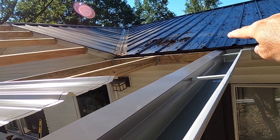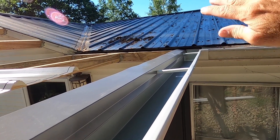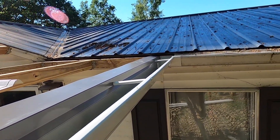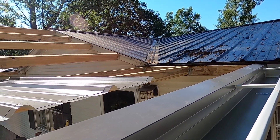Under the old roof I'm going to add a short section of roof for flashing, so that the old roof comes out onto the new roof to keep everything waterproof and prevent more damage than was already there from the past.